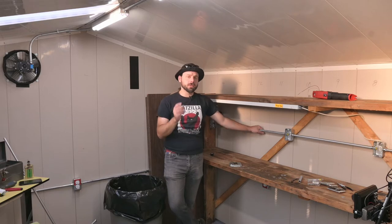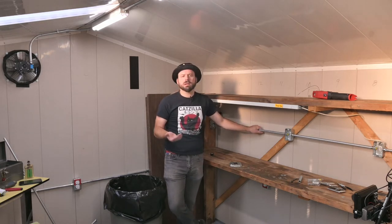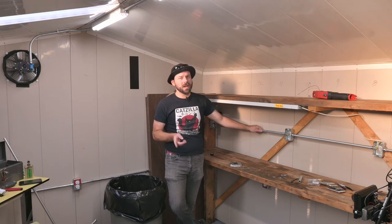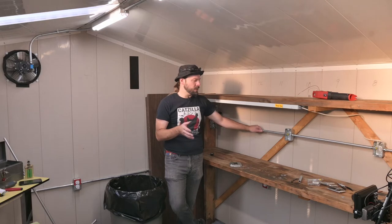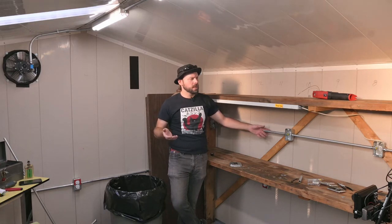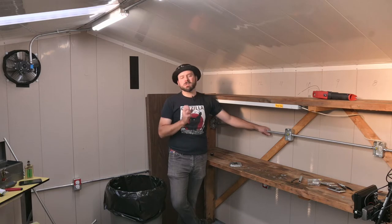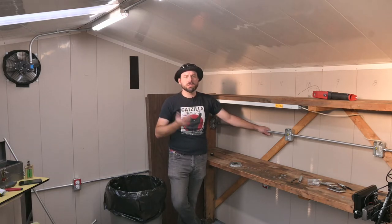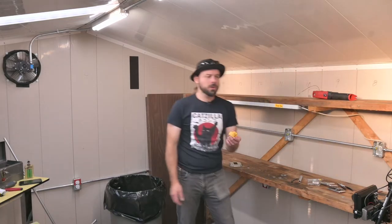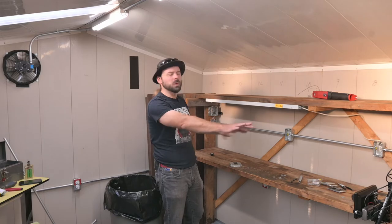You've probably noticed that on plain extension cords without overload protection they only have a maximum of three receptacles. Something like a power bar needs to have overload protection. This is made to much higher standards than a power bar and I'm going full 12 gauge spec, partly because that's actually what I have to work with. I've got a couple old extension cords that are chopped up that are 12 gauge, and all the single or dual conductor wire I have in stock is 12 gauge. Contrary to popular belief, spec grade receptacles are pretty much all 20 amp rated — if you rip the face off most spec grade receptacles you'll see T-slot provisions in there.